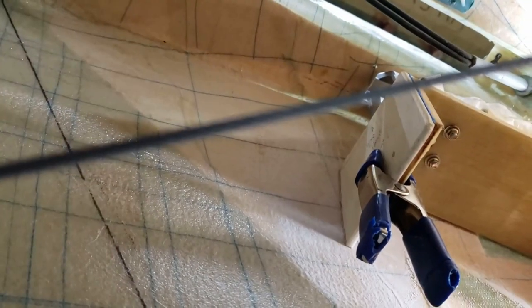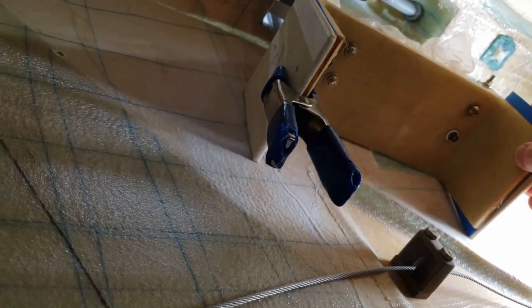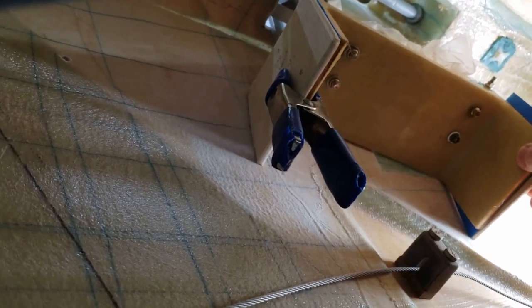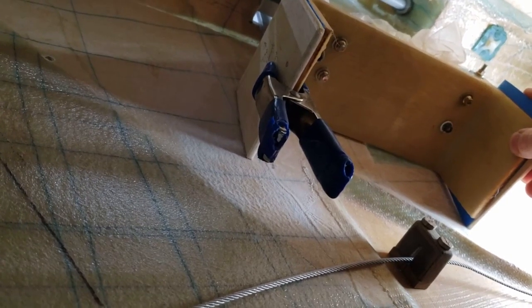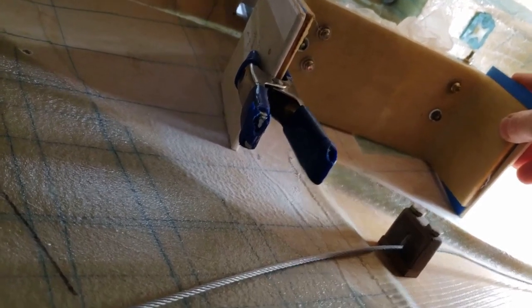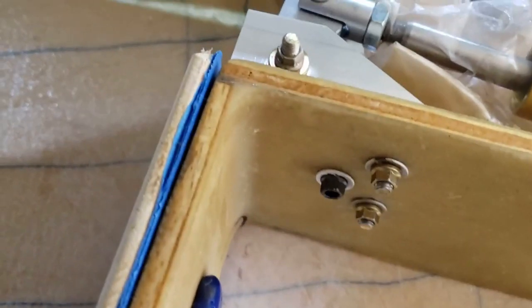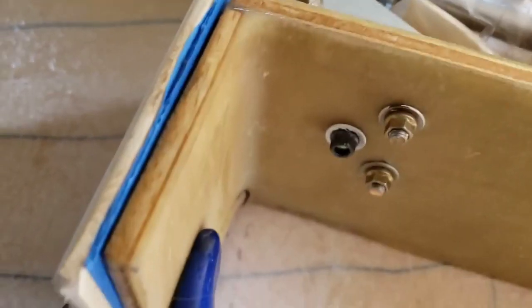Next, I'll be doing a layup that'll go from the side of the aircraft tunnel wall to the plywood face there. And where they meet, at the butt joint, I'll be laying in a little flox, which is cotton fiber mixed in with epoxy, and that'll give it a nice radius so the glass has a nice curve to it, so it won't lift and create a weak point or air bubble. Similar to what I have in here with this bracket, as you can see, there is a fillet right in there, so it radiuses from the 90.